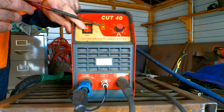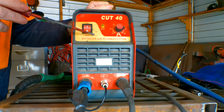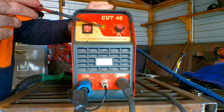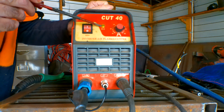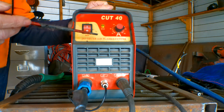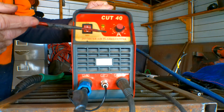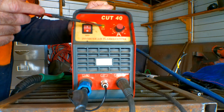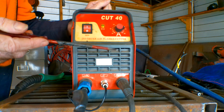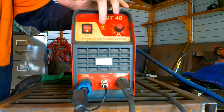Notice when I turn it on the OC light just flickers a little bit. This machine has a thermal overload, and if you push it past that limit the OC light comes on — and once it does, the machine doesn't go again. That's what happened to me in the first two weeks. I had to take it back to the shop; it only cost me seventy dollars to fix, but once bitten twice shy — I'll never do that again.